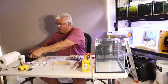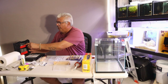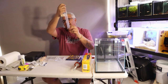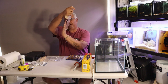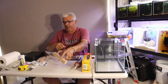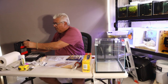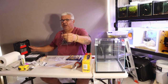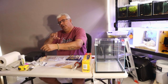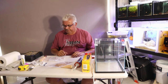That bottom screw effectively keeps it level against the glass so it doesn't sway — you screw it in, it pushes against the glass and holds it in place. You can just buy one tap from a local hardware store in a 3mm or 4mm size depending on the nylon or plastic bolts you're using, and use that to create the threaded hole for the screw to turn in. That's basically what you need from an equipment point of view.